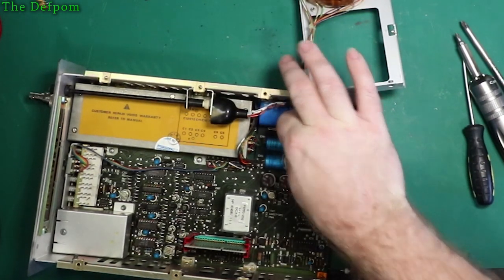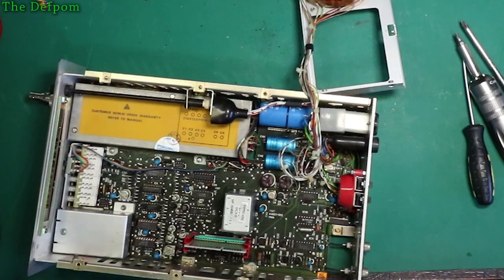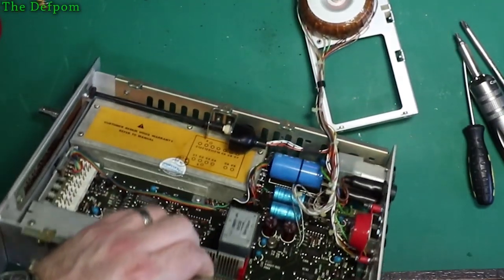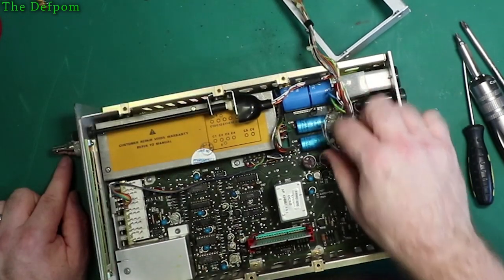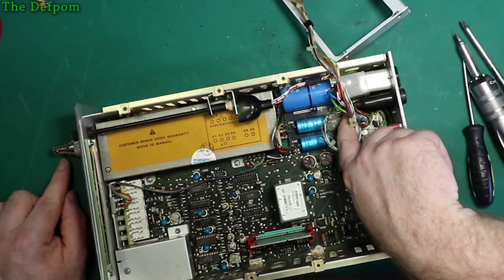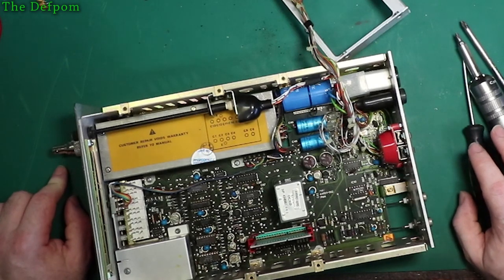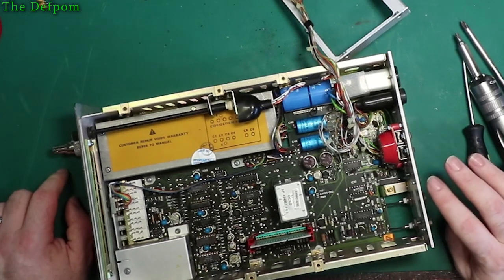And to try and figure out what this thing is. That strap around is just a piece of wire. I can see it soldered through on each side and the other side of the board there. So that's all that is. Well, we'll take both of those out, change those, and then figure out what I'm going to do about this thing. It looks like it's got wires going to posts sticking on the circuit boards, and probably desolder from the top. And if I desolder that wire, desolder those posts, I think it will come out.